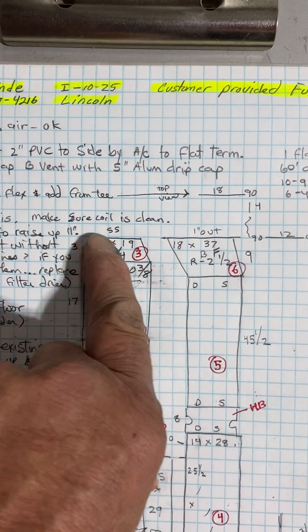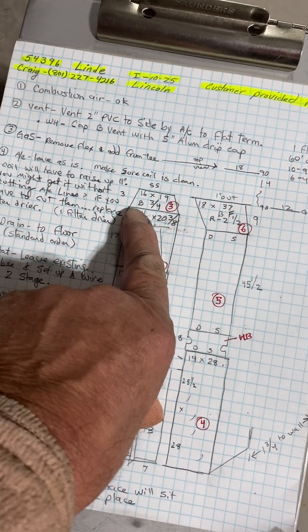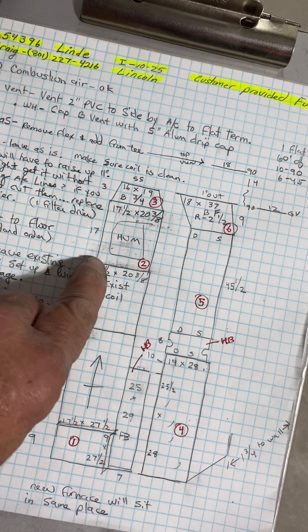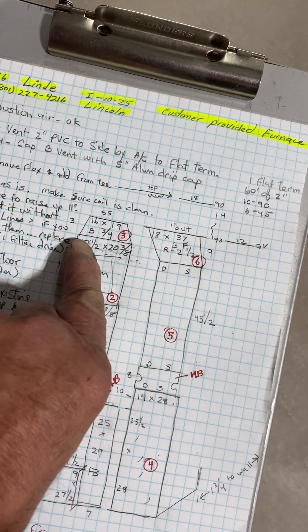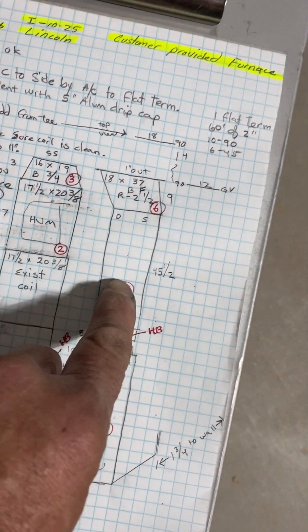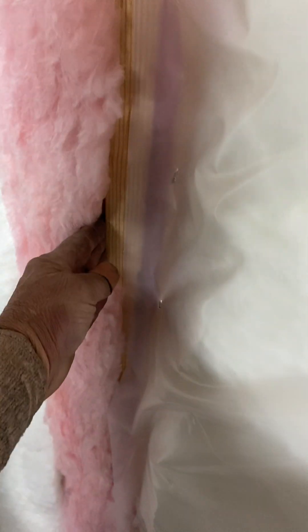I made a little 3-inch transition here. If you need to adjust a piece, you can probably adjust this — because 17 was from slip to slip, but we actually have an OCP on the bottom. Your cut line is on the side, right there. I also wrote about the humidifier — it's 1 inch at the bottom of the slip. Your return air cut line is right there, 1 inch from the sides. Your duct is going to come out to here, basically.